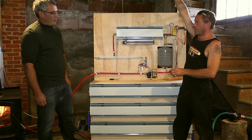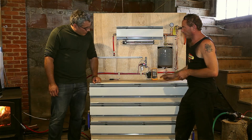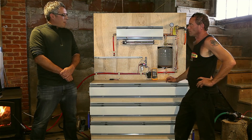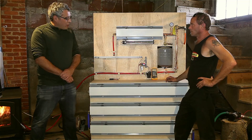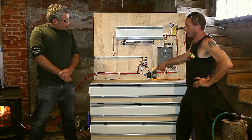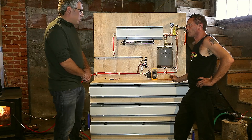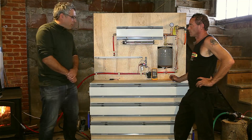So in other words, we could push water upstairs — that's what you mean by head. Yes, we could push it up to 15 feet with this pump. Wow, that teeny little thing! Yeah, and that's the smallest one we have. We have them that can push quite a bit more. That pump will actually move 5 gallons a minute, and we have pumps that can handle much larger head pressures that can move up to 15 gallons per minute. So this readout is the temperature of the water as it's going back to be reheated. Correct — as you can see, it's pretty high. Yeah, 115 degrees is a good place for your water to be as it's coming back.